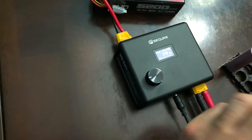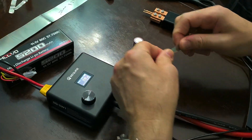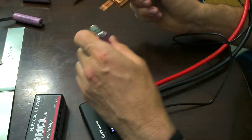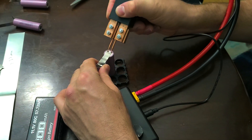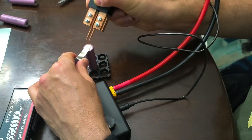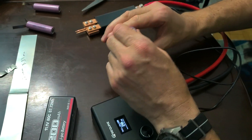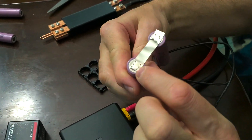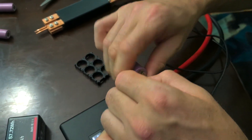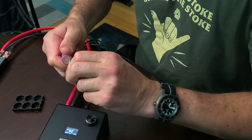Let's try one more time with another cell. Let me cut one more 0.20mm strip. I'll try to spot weld on this side with 0.20mm and see if it makes any difference. Very nice, clean — six welds right here, no burn marks. Let me try to pull this. It's not coming. If I go side to side, this one just popped, but the rest, if I pull straight, it's not coming out even when I pull really hard.